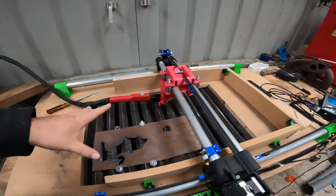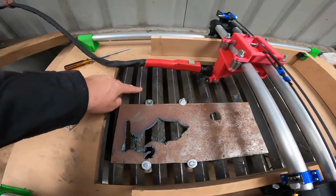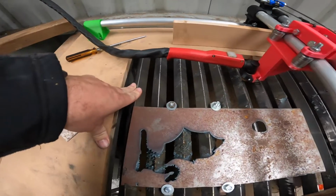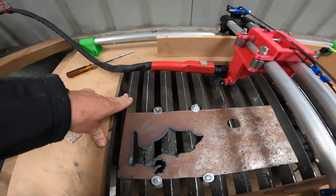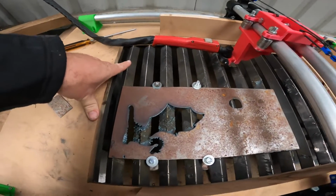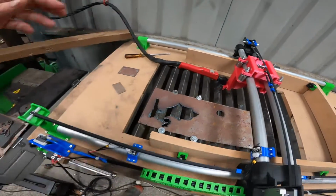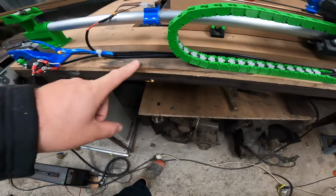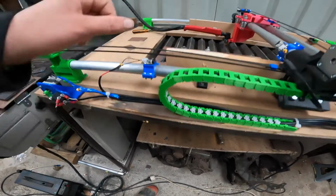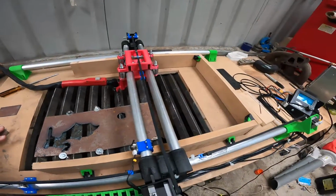Once that square's done, I cut it out and I made just a steel. I made this one just using angle iron. I like using angle iron because it works. I find it works pretty good. The arc just shoots off either side and it lasts pretty well. So that bed is mounted to my plywood table underneath, not actually to this cutted frame.